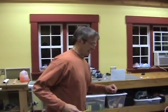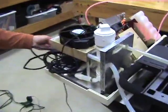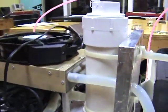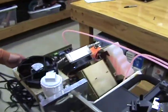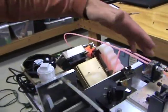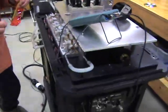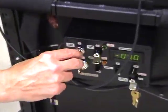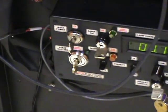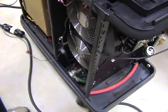I'm going to actually operate the laser so you can see them in operation. I'm going to turn on the pump — the liquid pump for the dye laser. You'll hear the pump sound in the background. I'm going to let this run for a little while so that any air bubbles that may have formed from dissolved gases have a chance to be flushed out of the cell. I'm also going to turn on the KTP laser, so you'll hear that pump in the background too. I'm going to let the system circulate for a few seconds to make sure there are no bubbles along the lamp or rod that could diffract the light.